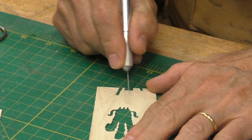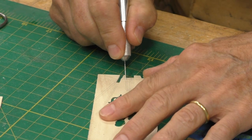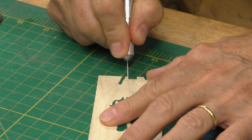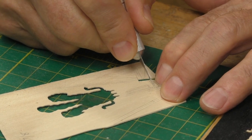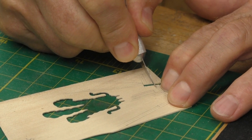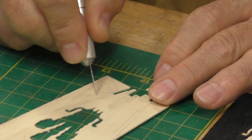And so here I've marked lines on my piece of veneer, and I literally just start taking it out. So I'll take out the big square, which is the full cross in it. And even with this, I have to be a little careful. You have to make a lot of scoring lines. It will shatter on you in a heartbeat. There it is. So that's out.